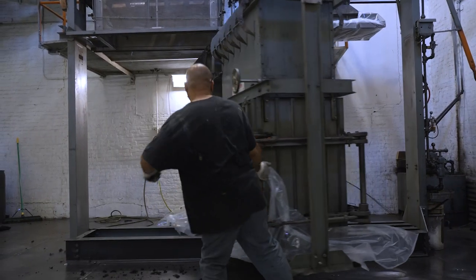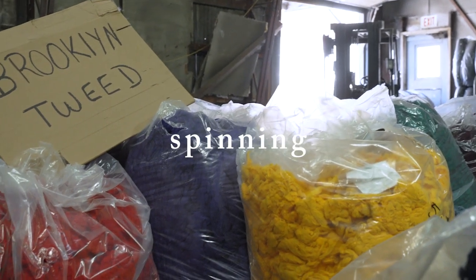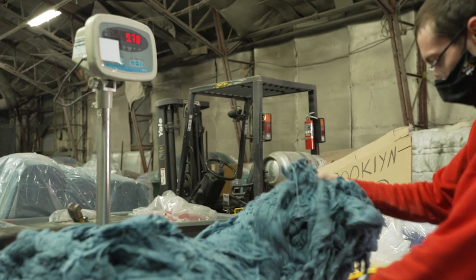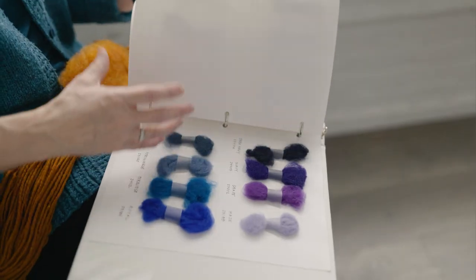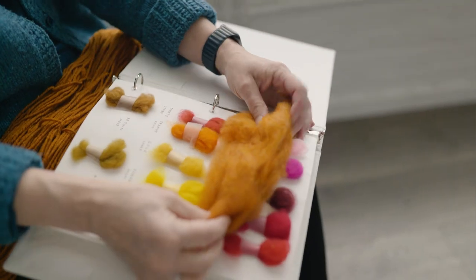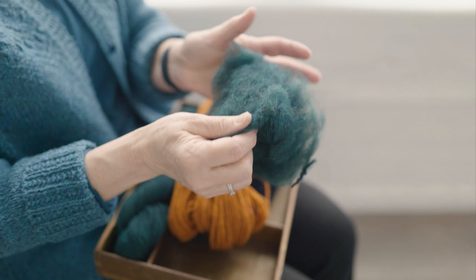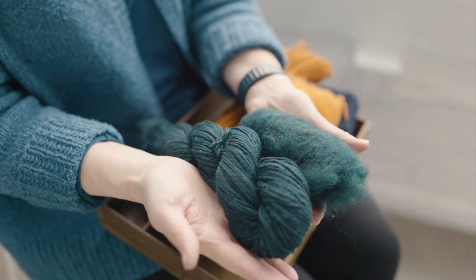Once we reached an agreement with Kramer Textiles in Nazareth, Pennsylvania, Jared needed to go and spend time at the mill. Kramer has a great situation where you can work with the color in this room and see pretty quickly how things look, so Jared invested quite a bit of time over the course of a week looking at colors and developing different blends. For example, we have solids — you start with solids — but this is almost like a recipe: a certain percent of orange and yellow and brown. You end up with a puff like this, and then it goes through the mill process, and this is the finished color.